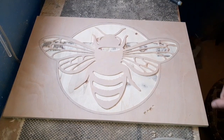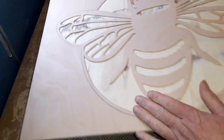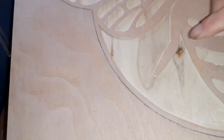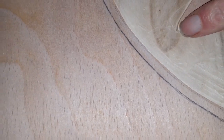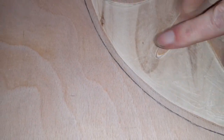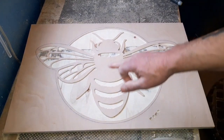That's enough tidying up and general cleaning for me - we've got all our nice edges. We've sanded them down just a little bit. Remember I mentioned sanding down too much - you can see that top layer has been sanded away there. If you were going to put paint in and do a lot of sanding be prepared to lose your top layer. That doesn't matter to us because we're going to stain, spray, or paint this black. Next stage is literally just to cut it out on a scroll saw.